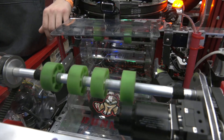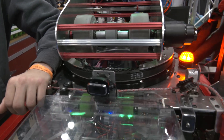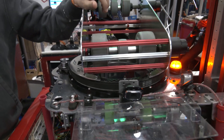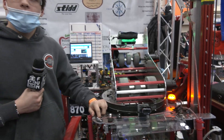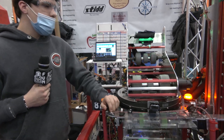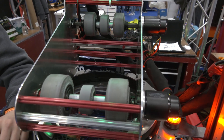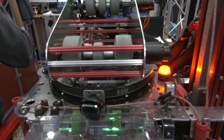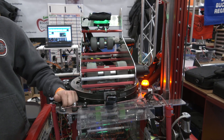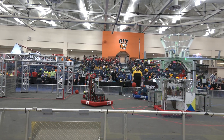Let's move on to the shooter and turret — Tom's going to talk about that. It looks like some custom 3D printing too, so talk me through what's gone into it. We went with the turret — last year was our first year ever using a turret and it's kind of a no-brainer. With the limelight and the turret it tracks pretty much anywhere you go. We have about 260 degrees of rotation because the climb gets in the way, so we don't have 360. Having the turret was lights out — a big help. We went with a two-wheel shooter because you could control distance and the amount of backspin, and instead of shooting balls way high, we thought a little backspin and placing it softly into the goal was the way to go.